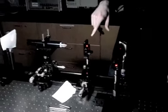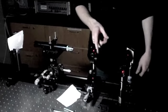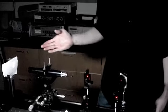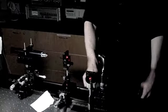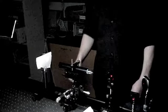So for this part of the lab, we started the laser in the furthermost extreme hole, the rightmost extreme hole of our Hartmann screen, which is set up here with a plano-convex lens with the plano side facing this way to get a shape factor of -1, which will increase the spherical aberration as we are trying to observe spherical aberration. We then navigated the mirror this direction, moving the laser's spot through each hole, and this changed where the spot was on here, and then we would adjust the microscope to find where the spot is and record both the location on this micrometer and on this micrometer. We can use that to calculate the lateral spherical aberration.